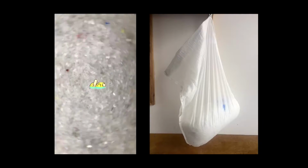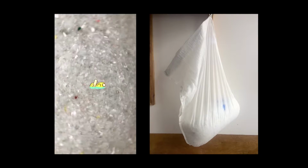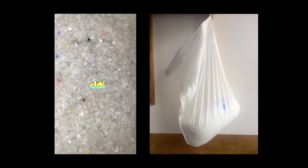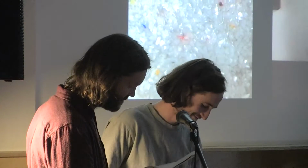The next step is to select the colours and weigh out 2.2 kilograms of plastic, equivalent to over 1,000 bottle tops. This is then rinsed and sieved to remove any non-plastic dirty gubbins and finally placed in a microplastic washing bag and popped in the machine. So once clean and dried, the plastic is ready to be melted.